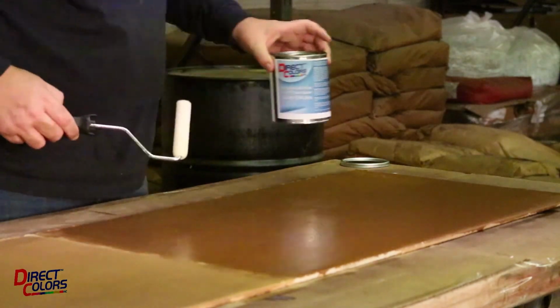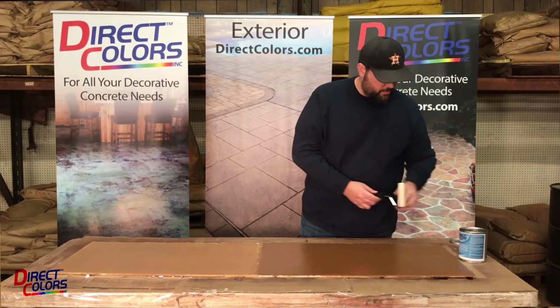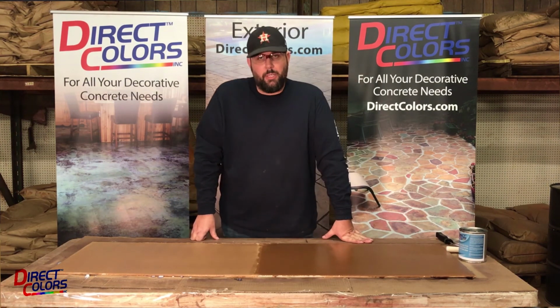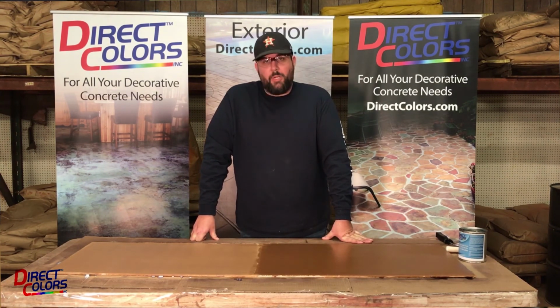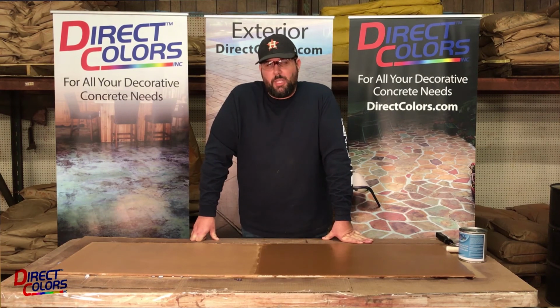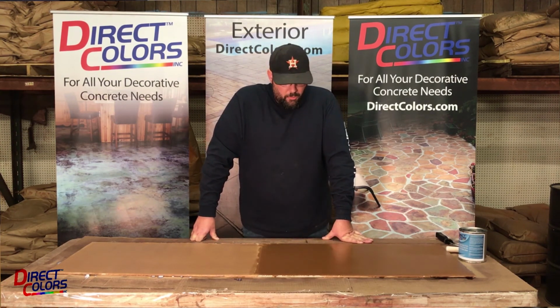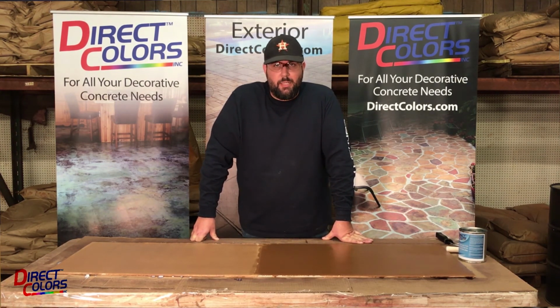Okay, so that's applying the sealer. A few little quick notes before we move on and conclude the video here. If we were outside, patios, sidewalks, driveways, anything like that, this would be the last process. Putting your second coat of sealer down would be the finish. And then it's just a question of letting it cure out for about 24 hours before you get foot traffic on it.